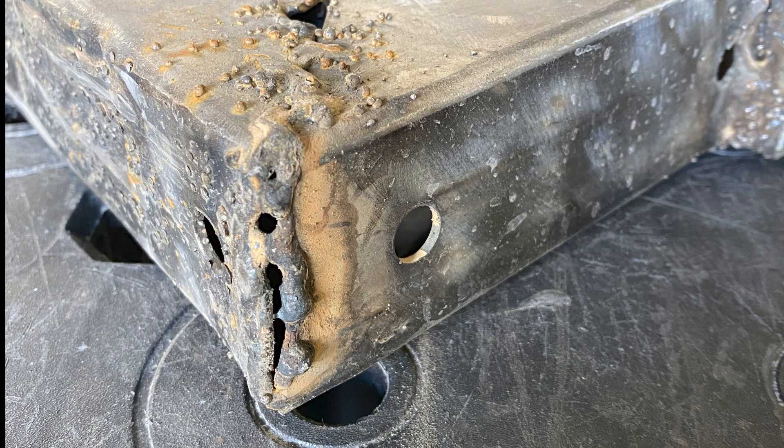My first attempt at welding was not pretty. The welder punched hole after hole through the steel, and I realized as I was doing the job that it came down to the fact that I had the welding settings for an eighth-inch steel and this looks like it's 16th-inch steel. So it was too hot and it just pounded through the steel. Here's an example of the welds that I was getting. Some of it had to do with my mask being too dark.